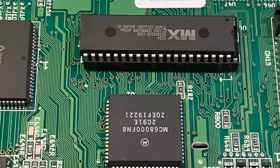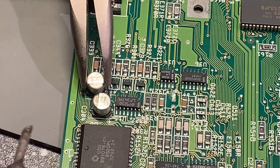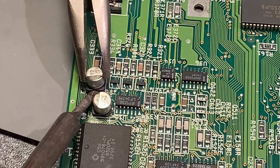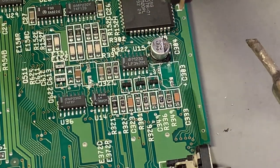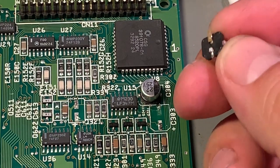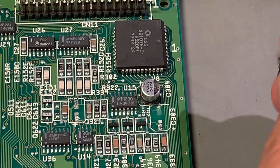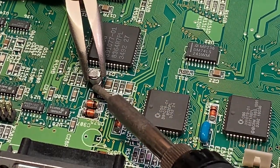And now I have to turn the PCB around. It's a bit hard when it's in between two components like this. Okay, it's lifted. Then I go back to the other side again. All right. So, even if I try to be careful, you see, unfortunately, I lifted one of the pads, and that has to be repaired, of course. So that's a bummer. I'll try to be even more careful with the rest.